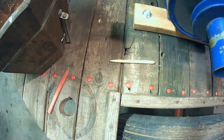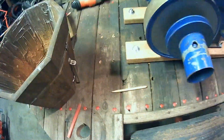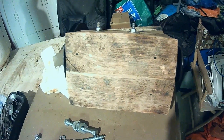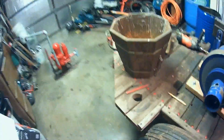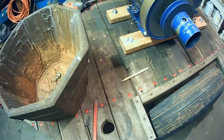I was able to go ahead and use a pencil — one of those old mechanical pencils. I was able to get it in the hole there and get our holes marked. This should be good. Now I'll go ahead and get this thing turned upside down and pre-drill those holes, because it is hardwood — that is oak that we're using. So let me go ahead and do that, and then we should be about ready to mount this.